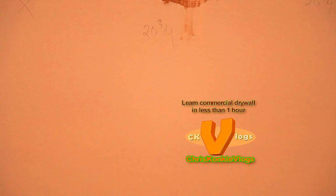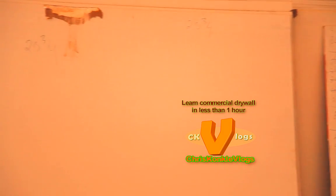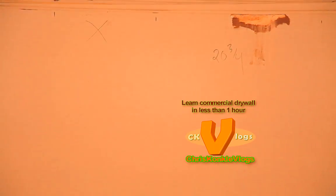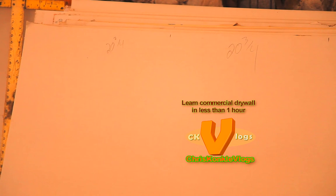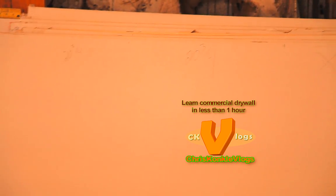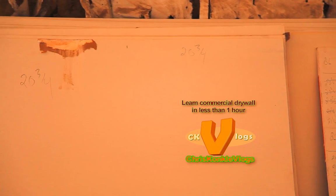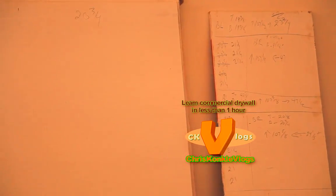All right. So also, it's important to, you can put a bunch of tops in one sheet, so you make sure you get them all marked. Write the sizes on the pieces so they don't get confused or mixed up, because you have the measurements written on the 10 foot, so you'll know where they go. All right, so make sure you do all those cuts at once. Snap them, rasp it, okay, and you're good to go. Their tops are cut. Cross them out as you go and just keep going. Keep doing that. And I'll show you how to cut the ends in after.